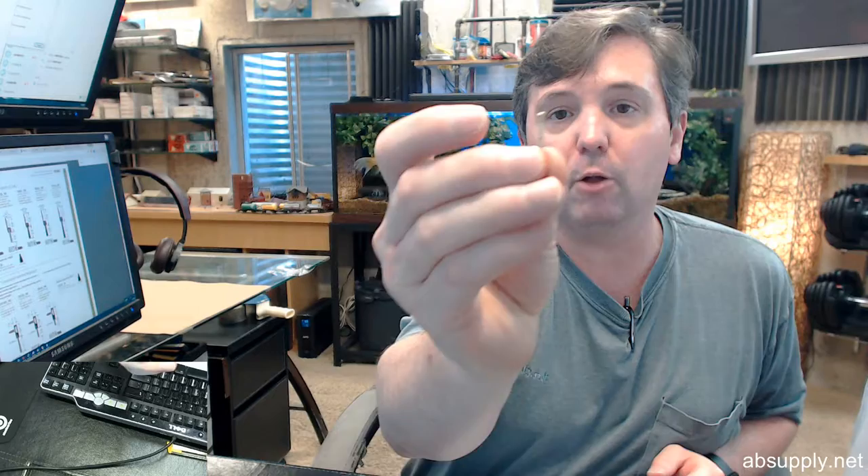It is brass plated, so it's a steel base, brass plated — a good idea naturally. Brass nails are soft, and only one out of a hundred thousand carpenters are going to say they've got to have that copper nail. A lot of people will enjoy having a steel-based, albeit brass-plated nail because it will allow you to get on it a little bit more than brass will. You generally don't need to pre-drill a hole for these, though I would drill through the material and drill a very small hole so I could set it tight and not have to fight the hammer or tack hammer to get it in.